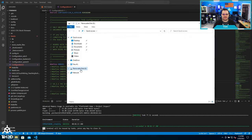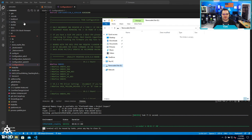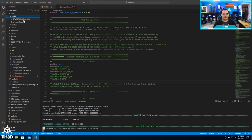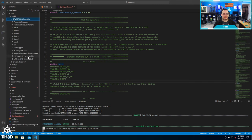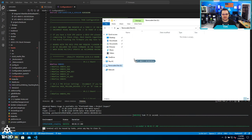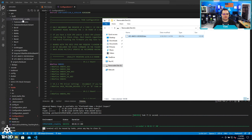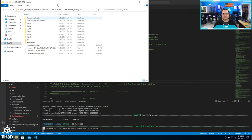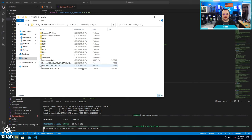There are two ways to get your firmware file. You can do it directly through VS Code on the left — your file is going to be in the PIO build folder and then a folder with the processor name, and under that you'll see a bin file. You can drag this from the VS Code window directly to the SD card. You can also right-click on the CPU folder, hit Reveal in File Explorer, and then you'll see the bin file. This is helpful if you have multiple bin files — you can sort by date modified and grab the latest one.